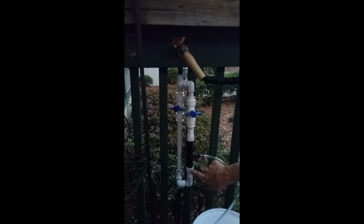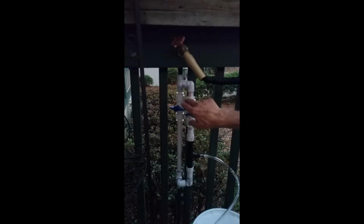Now this is a hose. This Venturi apparatus here is a hose fitting on both sides. So what you do is you get a hose to 1/2-inch slip, which means the pipe slips right up in it. You do that up here too. Then these valves, they're actually kind of a slip fitting. The pipe just pushes in. You don't really have to put any fittings, and it doesn't leak. Plus, an advantage is you can twist these.